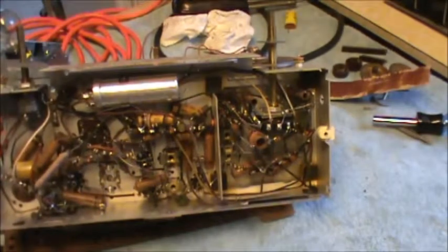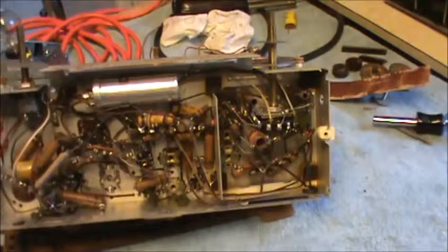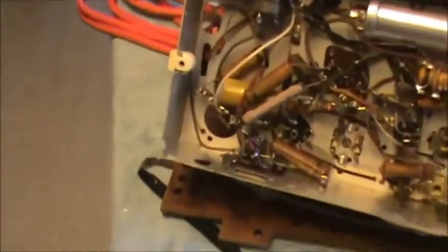There's some kind of interesting looking RF stuff. The band switch is kind of hid in here. This is kind of clever. This is probably the local oscillators all buried. And the switching is for AM and FM. Over on this side, what do we got? Anything good? There's the power input there.